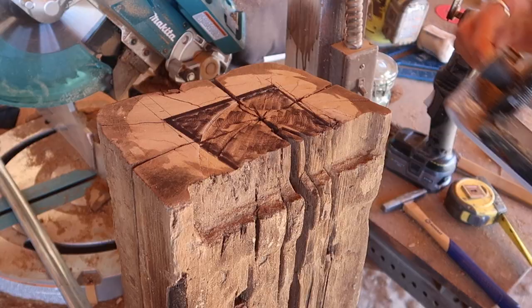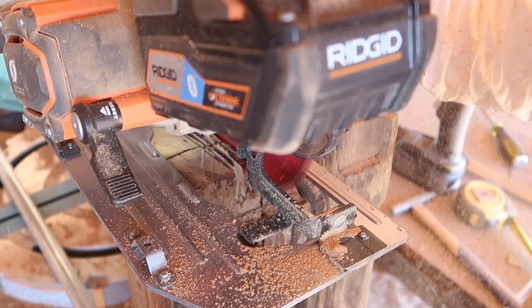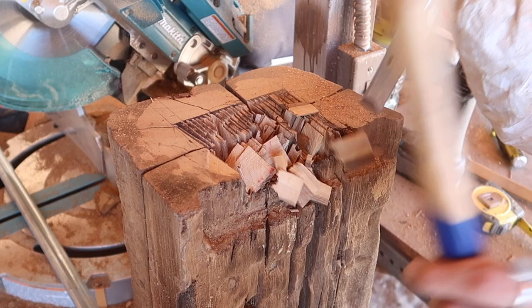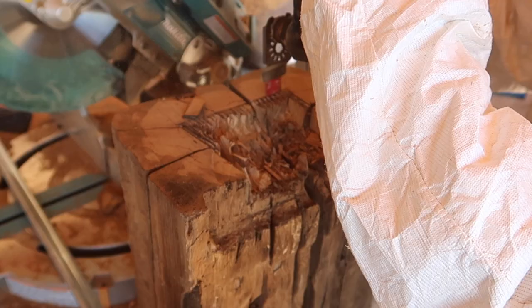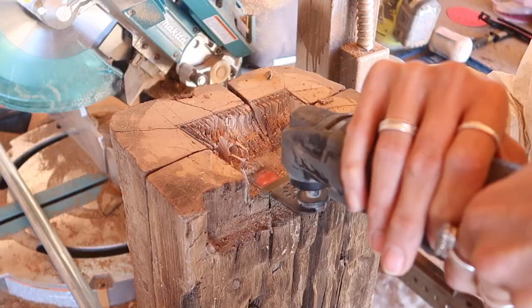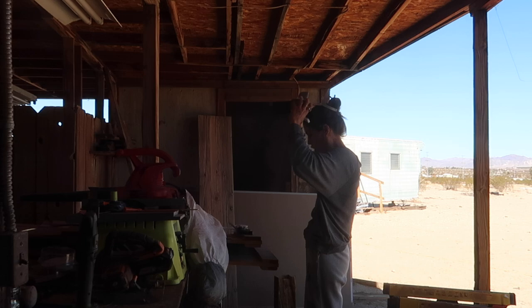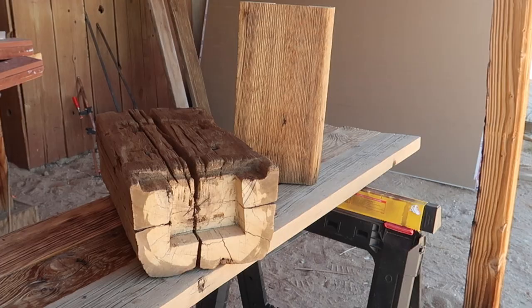It was kind of difficult to be chiseling something out level on a raw piece of wood, like I didn't cut this down yet, and I wanted that to be the look of it, so that's why I'm going about it this way. Also, I just want to note that what we are chiseling out is the thickness of the wood that is going to be inserting into it for the coffee table to create this joint. Well, this very beginner, very basic, very, oh, hey, I never have done this before joint.